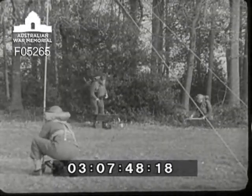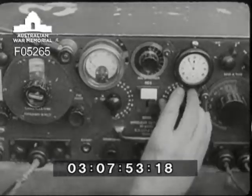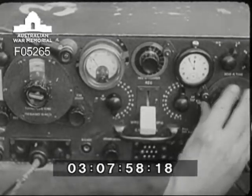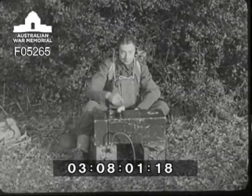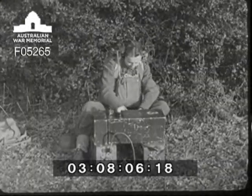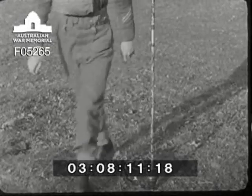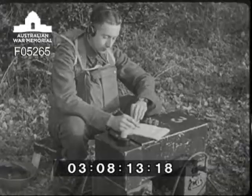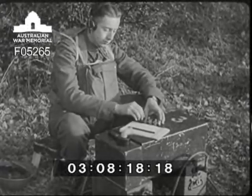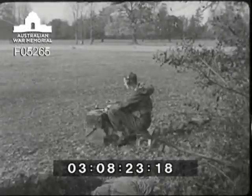When the mast is dressed, they get on with the tuning. Adjust the aerial tap, anode tap, down to send, and tune for maximum radiation. The main object of the tuning is that the ammeter on the aerial unit shall read as high as possible. The operators give a signal to each other when the maximum readings have been obtained. When the tuning is finished, operator two listens out for a clear moment in the group's traffic and then begins to re-establish communication. He's through after having been off the air for six minutes, which is record time.